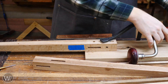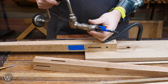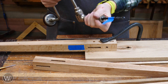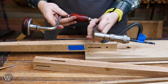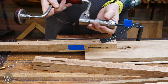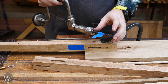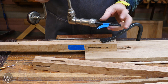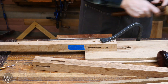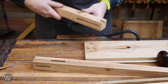I've had a lot of people asking me about having hex heads in the braces. Some braces have no problem at all with hex heads; some have a very big problem with them as opposed to the tapered square. This is a Miller Falls that I got a while ago — it's just a simple reversible brace and it works very well. It will hold the hex heads just as well as the square tapers. So if that's something you're looking for, try a hex head in there and see if it holds well. So now we have this hole drilled — knock it out, put the next leg in, drill the next bit, and keep going.